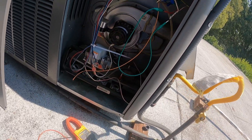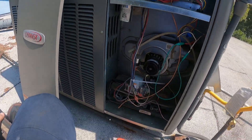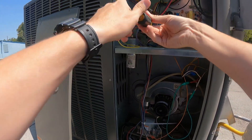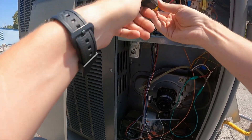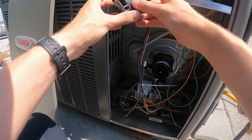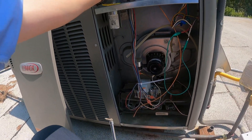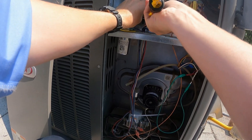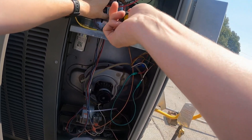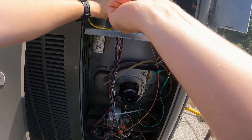What I want to do first is check inside that pressure switch and see if maybe it's clogged. I definitely don't see anything in there. For reference: if the inducer on the manometer was not reading negative 0.1 or higher, that would tell us the pressure switch may be fine and it's actually the inducer or something clogged up — then we'd move back and check all that.